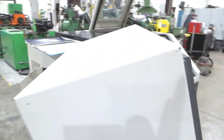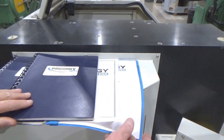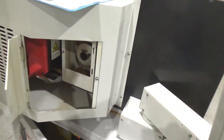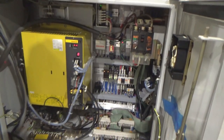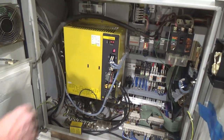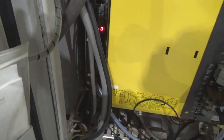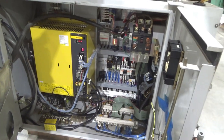Come around the top side — we've got the documentation for the machine: programming, maintenance books in here. And down low, the electric panel. Currently running at 208 volts. Got a couple of drives on one servo unit. The processor's way in back. There's my 208 coming in. And right up above it is where the bar feed would go in.